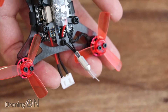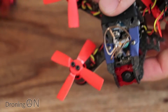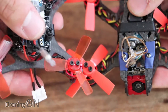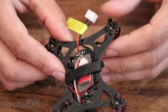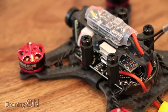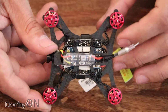What's really nice to see on the 90 GT is the dipole antenna. These are far more durable on micro brushless quadcopters — when you have a bump the circular antennas generally tend to get squashed, as with the Aurora 100 here. So it's really nice that the 90 GT hopefully has a little bit more lifetime. No longer do we have those speed controllers stuck to the undersides of the arms; instead we have a four-in-one speed controller and flight controller board tucked neatly in there, so we don't have to worry anymore about breaking those speed controllers on each landing.